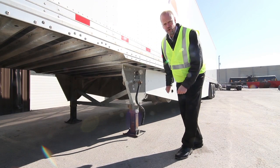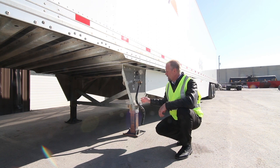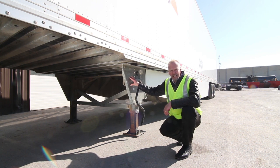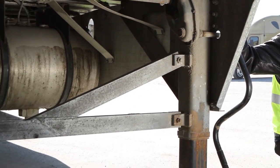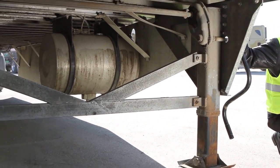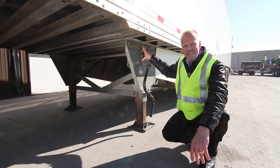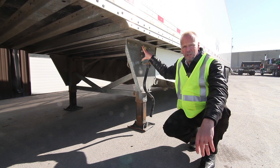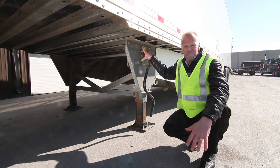We've made a notable improvement on the landing gear. We've increased the landing gear capacity for reliability, and the whole landing gear sub-assembly is all galvanized, which will reduce corrosion and make it very easy to change out. The whole landing suspension is now bolted on — traditionally it was welded. The amount of time required to change out the landing legs is reduced by at least 50 percent.